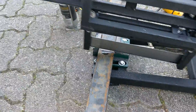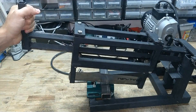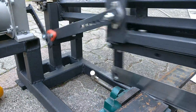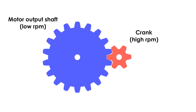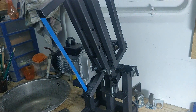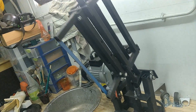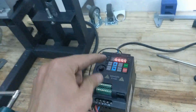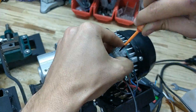To increase cut speeds, you basically have two options. You can push the blade down harder, but as we saw, that will cause issues — if the blade doesn't snap, it will definitely twist and bend, resulting in a very unsquare cut. The other option is to increase the speed of the blade and therefore the motor. We could play around with the gearbox, removing some gears or adding a chain drive, but I'm way too lazy for that. I own a 1.5kW VFD which I use to control the speed of various induction motor tools in the workshop. I programmed it to run from 0 to 100Hz — 100Hz will basically double the speed of the motor. Keep in mind that when you increase the rotation speed, whether using gears or a VFD, the output torque will decrease since the motor's power consumption shouldn't change. That's why I chose a rather beefy motor to have plenty of headroom.